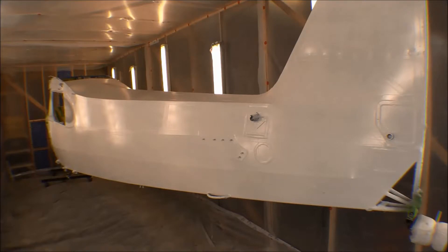The cap on the lid of the paint cup on the gun wasn't sealing right, and every once in a while a gob of paint would flop out and land on there. Those flowed out okay - actually pretty good once I got going. I had wiped them down with a rag and made a bit of a mess but it wound up coming out okay. So that's one cross coat of white, and it covered it up pretty good. A couple more coats would look really nice if painting it white, but it should help the yellow stand out and cover faster.